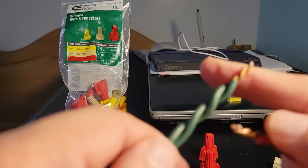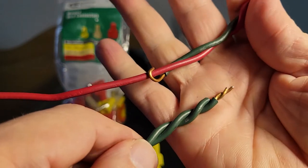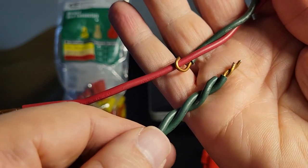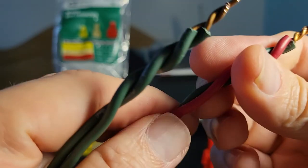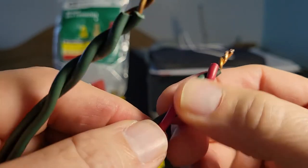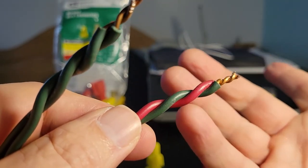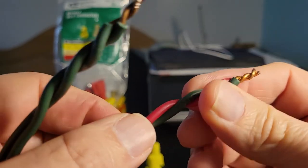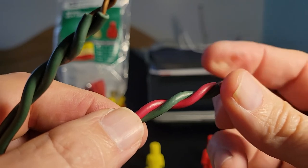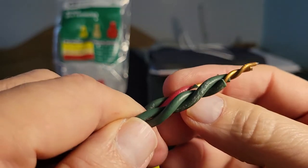And I think that's part of the issue that electricians have, is that because it's uneven, it could potentially come loose. I mean, if the wire nut comes off on this one, it's still held together, right? It could still cause a short, and that could still be an issue, but you're not having these wires separate out and then start sparking across because there's intermittent connection, which could cause a fire.